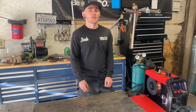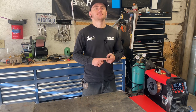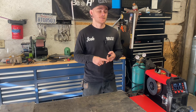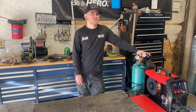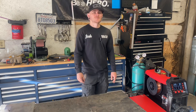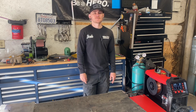To wrap this up, the main things to check when your wire isn't feeding properly: number one, check your contact tip — make sure it's good or new. Check your drive roll tension and your drive roll cleanliness. If neither of those are the problem, probably think about getting a liner. I hope this video helps you out. This is all very basic beginner stuff you need to know if you're going to be running a MIG welder. Like, comment, and subscribe if you want to see more how-to's or equipment reviews — drop me a comment on what you want to see next. Thanks for watching.